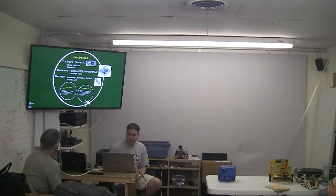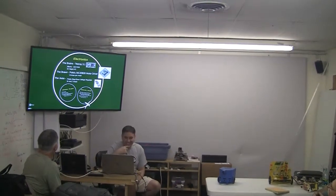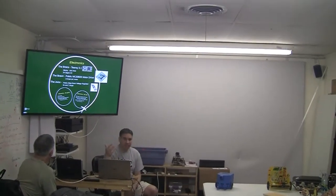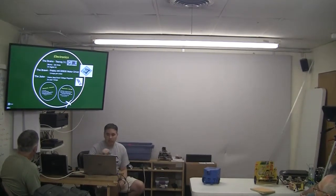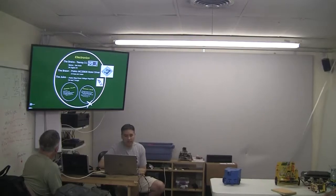So that helped out. I was using a Pololu motor controller, and you can see this could only handle 3 amps per motor, and my stall was 6 amps per motor, so good thing I wasn't pushing it that hard. But also, that was 6 amps at 6 volts. While I was running it all through a regulator, which was 5 volts, I was bringing down the voltage of the motors, and that regulator can handle 7 amps.